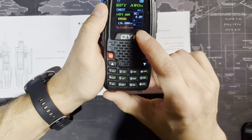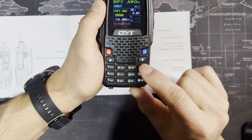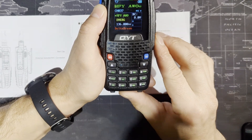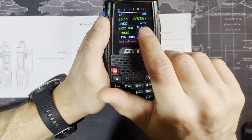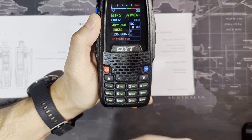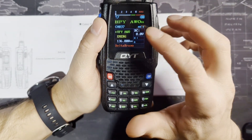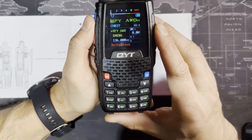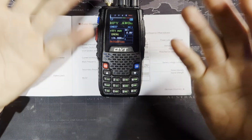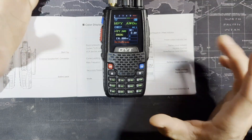The signal strength of a signal coming in or going out is shown there, along with the noise level when you transmit or receive. That's helpful — if you start seeing a lot of noise, you can adjust your squelch. I normally leave squelch around 10 or 11, but every radio and situation might be different. There's also a mic audio indicator that changes every time it picks up sound, which can show you how loud the environment is.